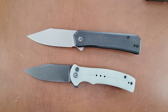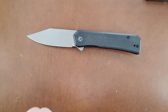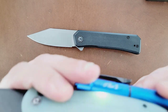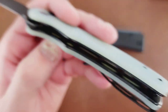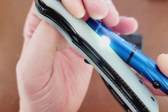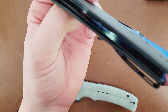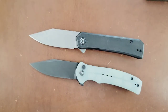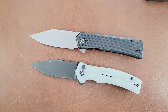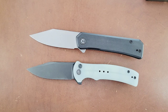Before we move on with the rest of the specs, let's jump into why one of these weighs more than the other. Because they're virtually the same knife, there's got to be a difference. That difference lies in the fact that the Cogent isn't a liner lock, meaning they can totally mill out the inside and not have any obstructions. As you can see, all of that is milled out — areas they've taken out due to the fact that there is no liner. With the liner on the Relic, they did mill out the show side as much as they could, but because of that liner they weren't able to mill out the liner side — that's where some of the added weight comes from. They also had to make the scales slightly thicker due to the pair of tweezers in the back.